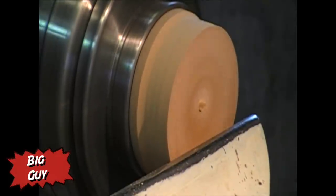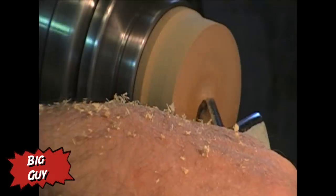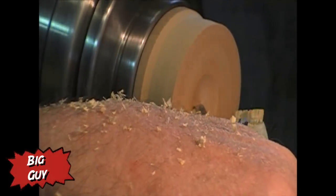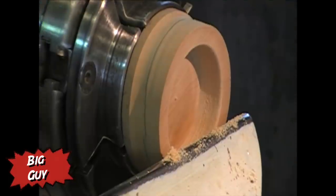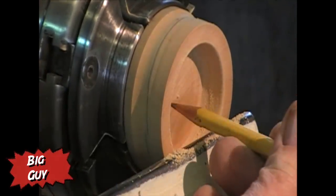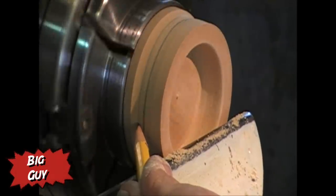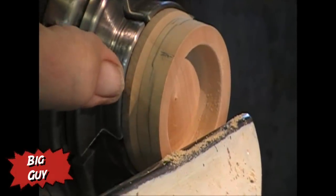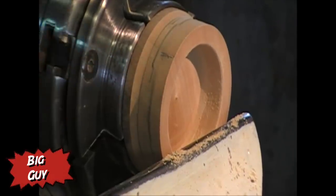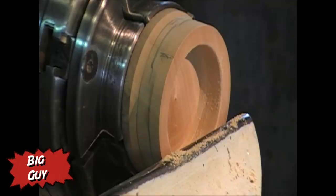I want to start this by hollowing the center of it a little bit. I've done a little hollowing and put this depression in it. This depression roughly runs to about here, which gives me about a quarter to three-eighths of depth for the lid. If I want to take it to the ornamental machine later and put a rose or something on top, I'll need that quarter to three-eighths of an inch. I used the boxwood for a couple of reasons: it's soft, it's pliable, it cuts good threads, it's pretty, and I can emboss it later on the ornamental machine.